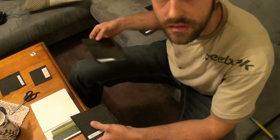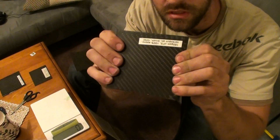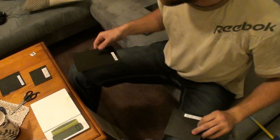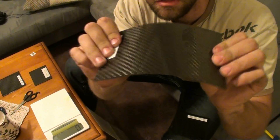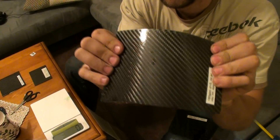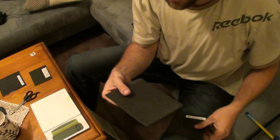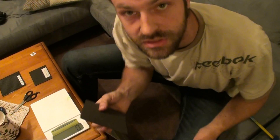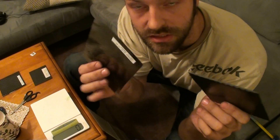The stiffness will suffer with the infused piece. The brushed 5-sheet piece is extremely stiff, while the vacuum infused one is not so stiff — pretty flexible actually. But it's flexible in a safe way; it's safe to bend and it won't crack nearly as quickly as a piece of this thickness made with a brush would crack.